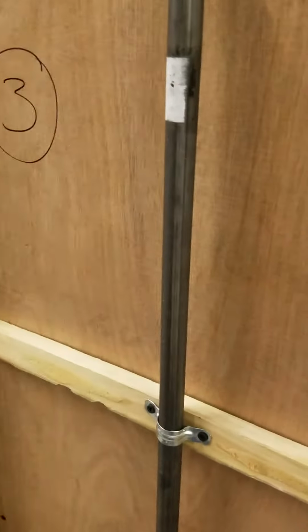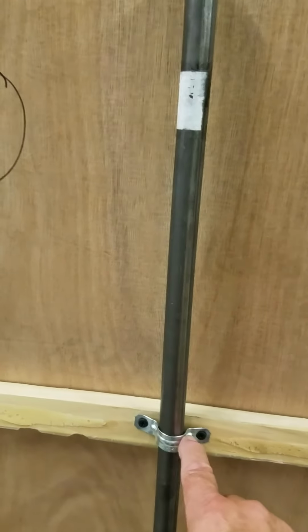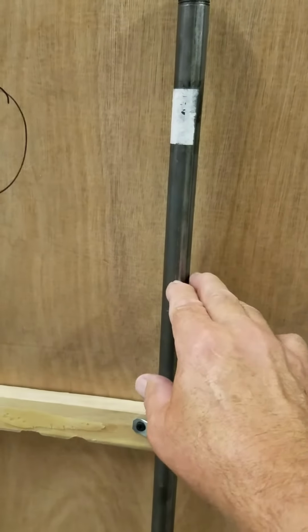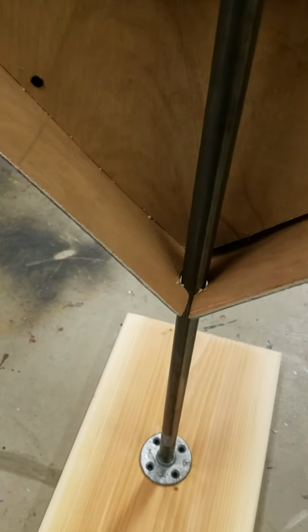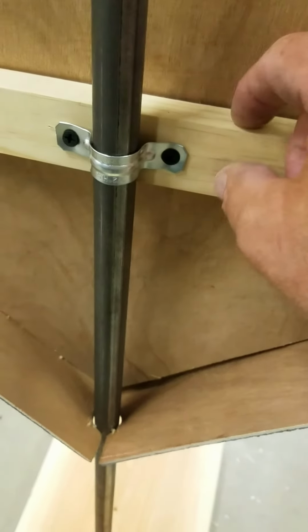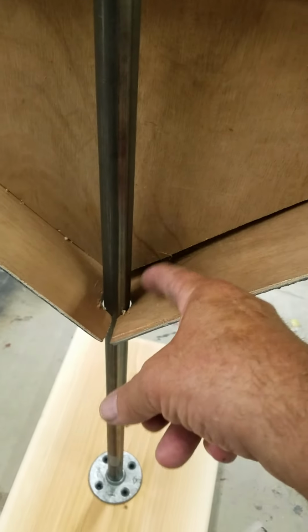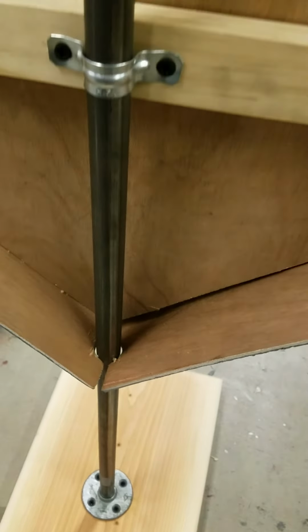Now on the back side, as we're putting the pipe in, remember we put our supports in already. So now we use these, which are called conduit straps. And this is a 1/2-inch black pipe. As we come down here, we had to drill a hole for our 1/2-inch pipe. And these being 3/4 inch wide, we came from the plywood on out, and that's where we started our hole, 3/4 inch away from the plywood, to give us a good straight plumb once we put it in.